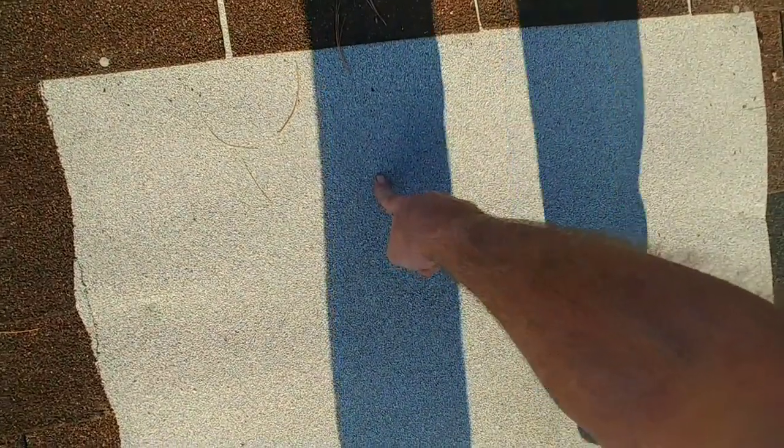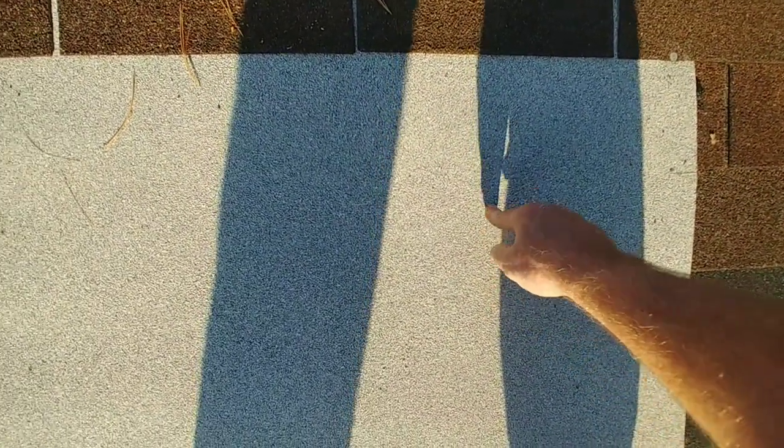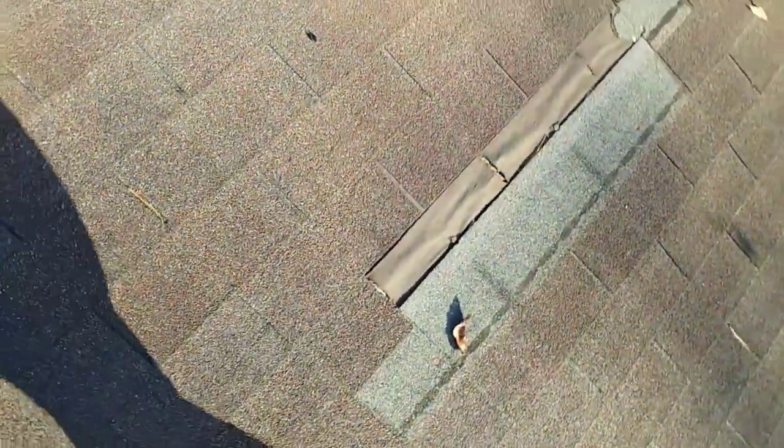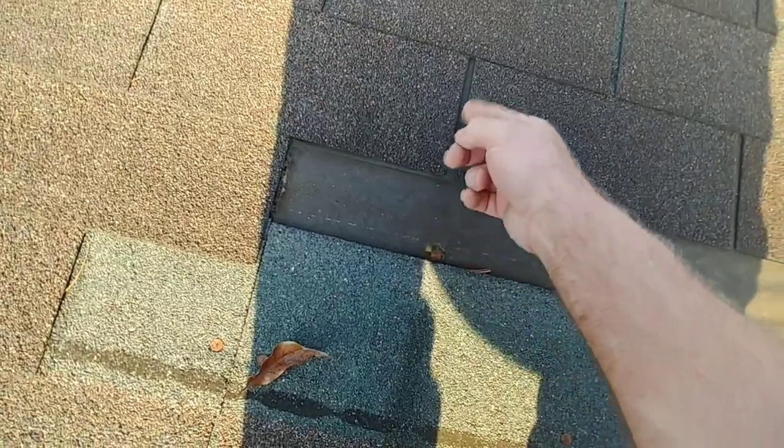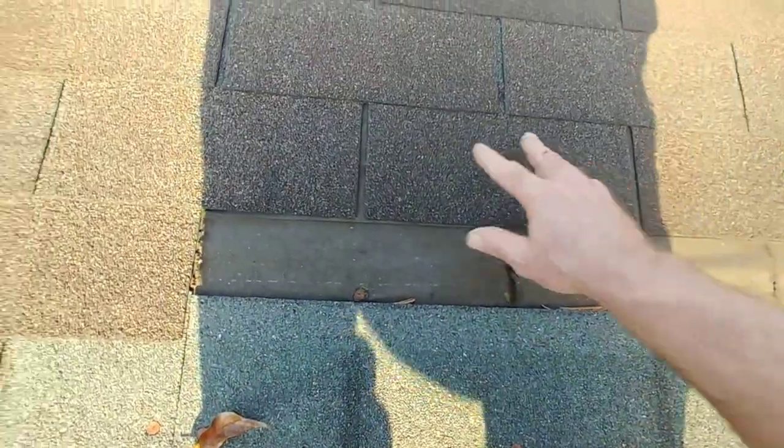So in the center, that's where this was at, but it was down a row. So it was on this row from about right here, and it went over to about right here. But we have put a shingle well above it, well to the sides of it, and well below it. And we sealed all the way around it. So no chance that's going to leak anytime soon. We are going to do the exact same thing with the missing one here. So we're going to skip this shingle because that underneath of it is obviously missing. This is missing. We're going to go up here.